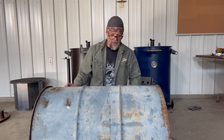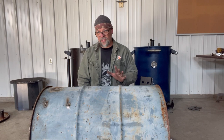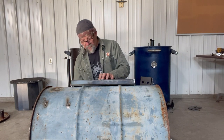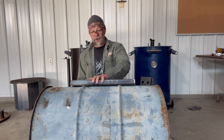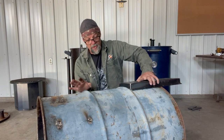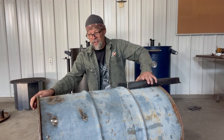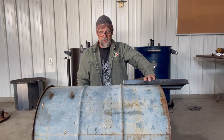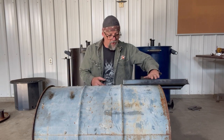Another important thing to keep in mind is the height of this rib. I've never seen a barrel that had a rib — from this surface up to the top of this surface vertically — that was more than three quarters of an inch. Now that doesn't mean they don't exist. So if you want to verify that number, use your intake like this or a straight edge, set it across two ribs, take a tape measure and measure it. Mine's right at seven sixteenths of an inch, so that's less than a half. The reason that matters is because if this rib was taller than three quarters of an inch, it would block off most of this intake. Three quarters of an inch evenly radiused out inside of this leaves you way more than enough room for airflow to get through the intake. If it's more than three quarters of an inch, you're going to start creeping up on it. Would it work? More than likely yes. Because a little pinhole — any drum guy with experience will tell you that even a pinhole will let you overrun your temperature — so it needs to be dang sealed tight.